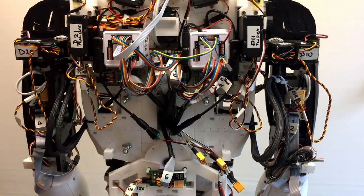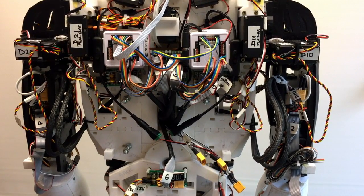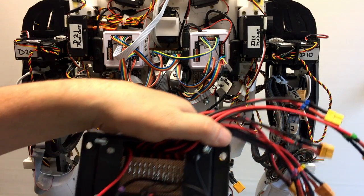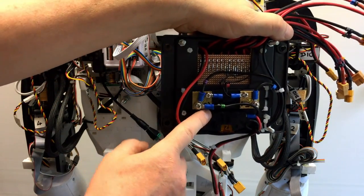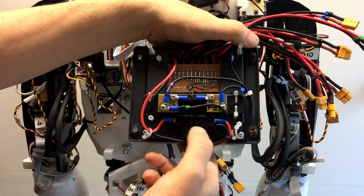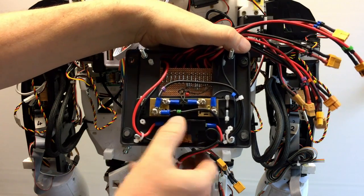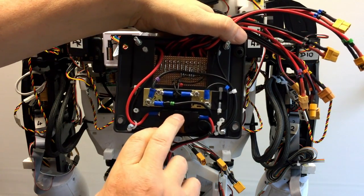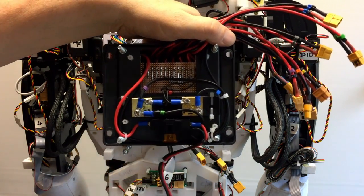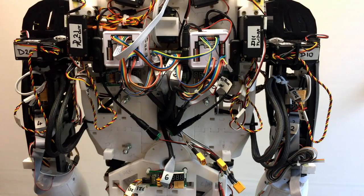But it's getting there. So I'm now going to mount the power supply distribution unit. Just back to the distribution unit for a second. Since earlier I put a fuse in there, which is now a blade fuse. That's actually a 40 amp one. I've got it just to make the connection and test it. I'm going to put a 20 amp in there, just so there's some form of fusing post power supply. I've made, I will show you, hold on.